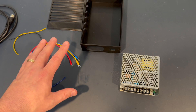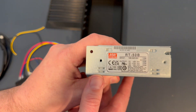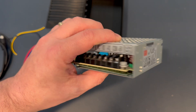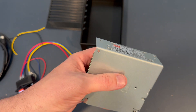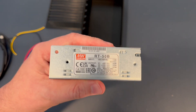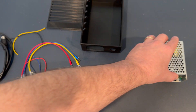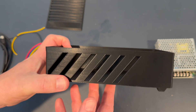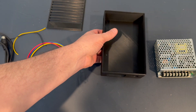All right, let's go over each of the different parts and components that we're using here. What we have is a Mean Well RT-50B power supply. It has plus 5 volts, plus 12 volts, and minus 12 volts, and this is necessary for the 520ST. The internal power supplies that you'll find in the 1040STFs, 520STFs, STEs, etc., they only need the plus 12 volts and plus 5 volts. There's a voltage regulator in the STFs that will generate the minus 12 volts needed for the RS-232 port.